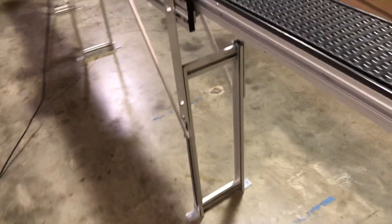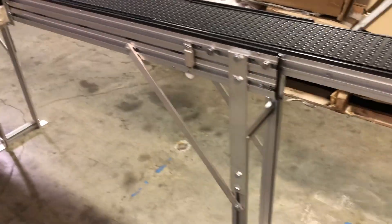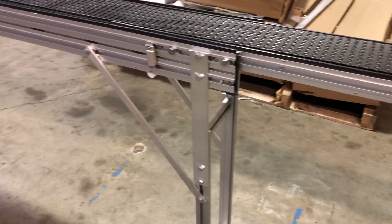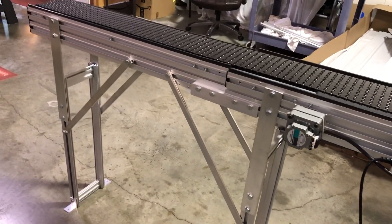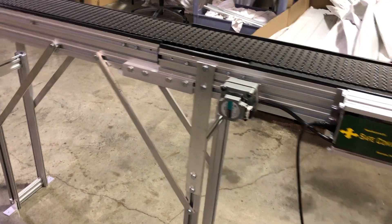What I wanted to show in this video: we make these videos for the customer so they can see their product fully assembled, which sometimes they just look at the video and it's put together with that moving section with the single stand. Each one of these sections has struts — there are two on the tail end. We're running the strut to give a little extra support to the extension section so we're not putting all the load on just that one joint.